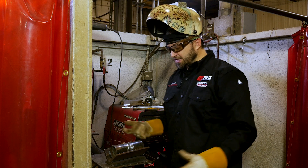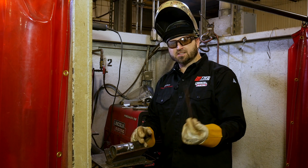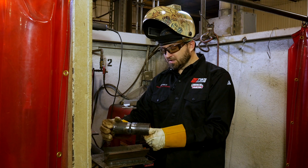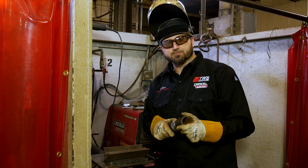Just like that. Snap the wire up the rod, bend the rod over. Nice, clean, easy — comes right off. Nothing to it. So now we've got our pipe all tacked up. It's ready to go. I'm going to get everything all cleaned up, get it tacked in the 6G position and then we'll get started on our welding.